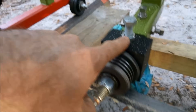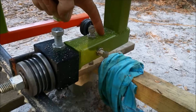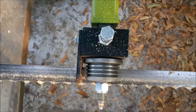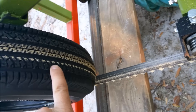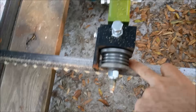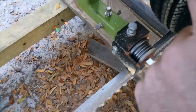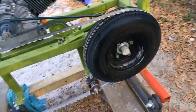The bolt slides all the way through and back, and as you tighten or loosen it, it shifts the guide in all directions until you get it lined up with your blade. Because I'm using rubber wheels instead of actual band saw tires, I set my gap here just a little bigger than what Cook's recommends — it tends to ride back further on these wheels than it would on a solid or rigid wheel.